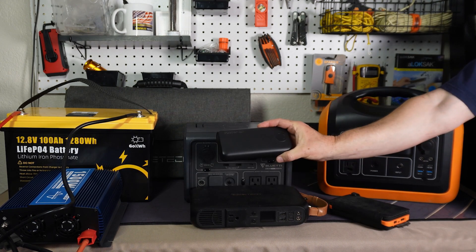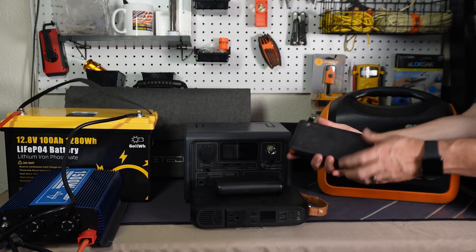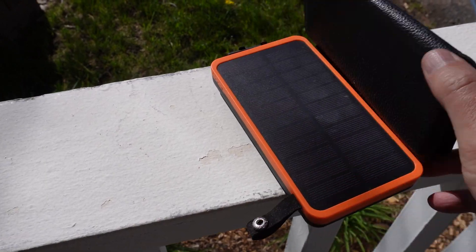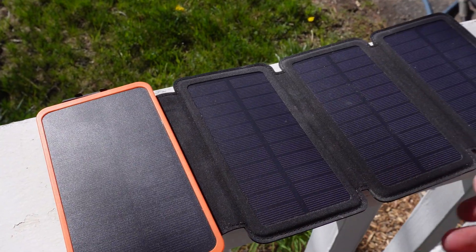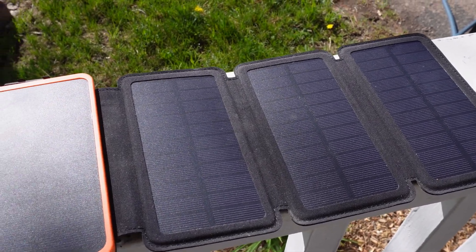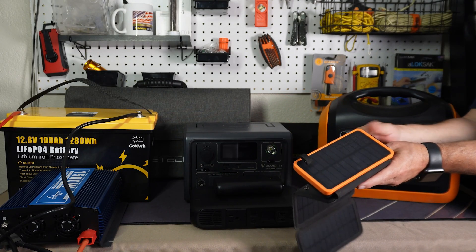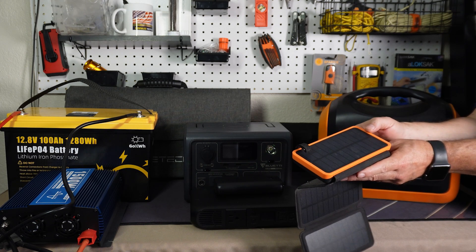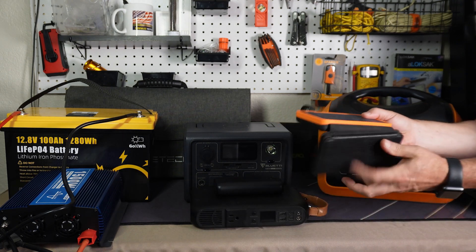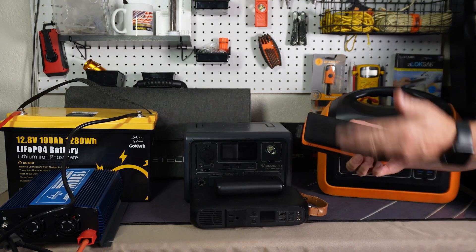There are a bunch of different kinds of these. Some of the smaller ones have solar panels — this one has four solar panels on it. I tested it and in an eight-hour day you can get about a third to half of the energy back if it's completely drained, just pointed at the sun. Some have just one solar panel and they don't work as great, especially the cheaper ones, but they will give you emergency energy. This one states 2,500 milliamp hours but again it was about half.